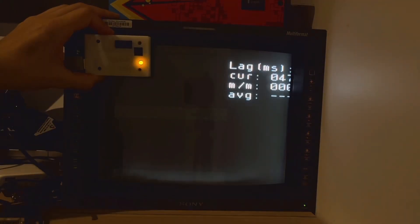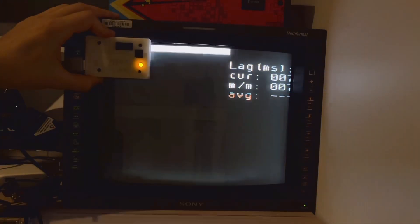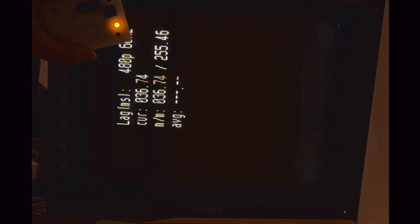480i and 240p through DVI are grossly overscanned, but that's what the S-Video input is for. The Jr. can also rotate and mirror flip the image on the X and Y axis, but needs to buffer a whole extra frame — with a variable 35 to 51 milliseconds, so effectively 2 to 3 whole frames to downscale and rotate the video.